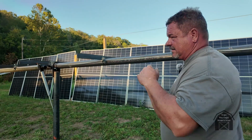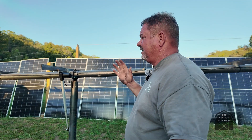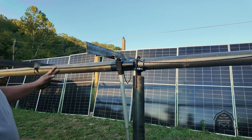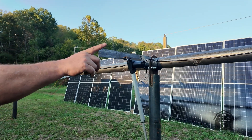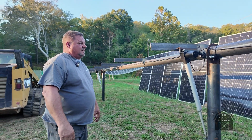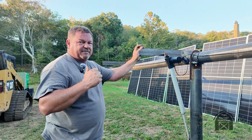I brought the cable feed to even up the load, because I think they all move pretty much the same — the difference in movement isn't really noticeable as long as they're all functioning properly. There's one cable here and two cables there because I brought the feed all the way down to the center, so it's exactly even going out in both directions — that's for wire resistance, to keep the voltage pretty much the same on all of them.